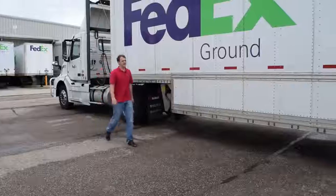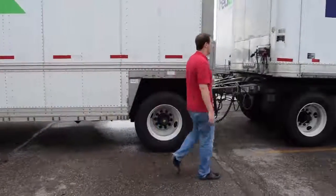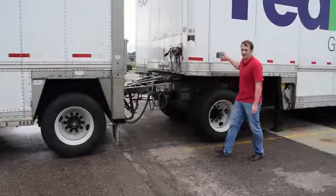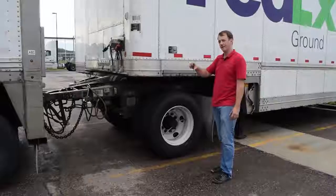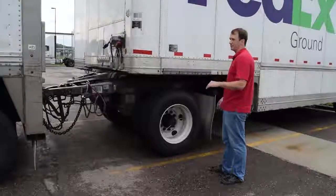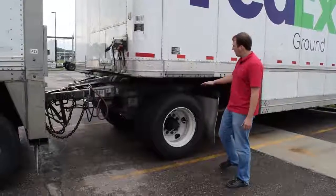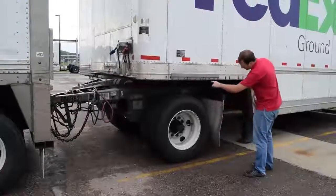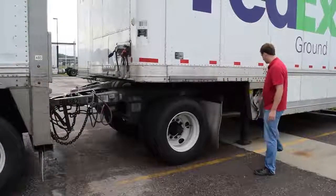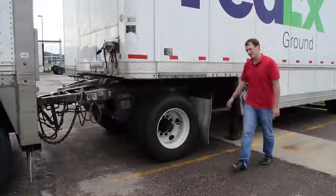On the dollies that have the airbags, after I hitch it up to the rear trailer, I like to apply only the tractor air, because if you were to set the trailer brakes as well, the emergency brakes, the dolly is then going to dump all of its air, which means that the fifth wheel plate would be hanging from the kingpin because the landing gear go back to the ground. And then I can demonstrate that real quick here.